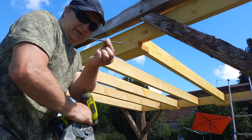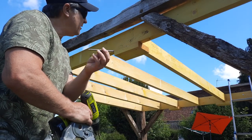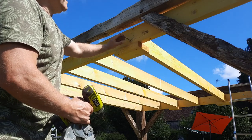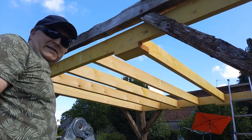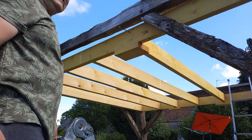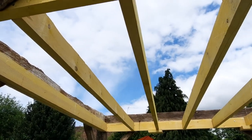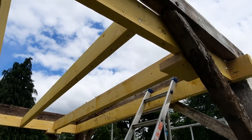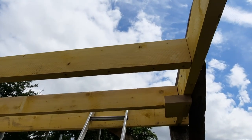Because I'm using six-inch nails I've pre-drilled where they're going — normally you don't have to pre-drill for nails, but because they're this long it just helps to get them started. There's plenty of length and plenty of material. I've just finished installing the suspended floor joists for the first floor. They've all gone in okay, so my next job is to put the two end A-frames up — that's what's going to support the top ridge beam, which is the uppermost triangle on the roof.